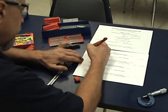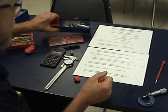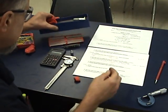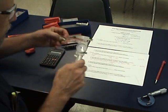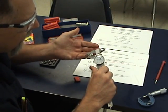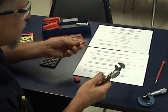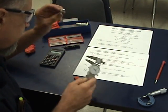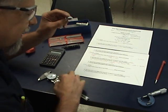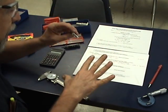I'm going to do number two right here. It's a 5/16th 18 thread bolt. I looked in my box of bolts and found something that looked close to a 5/16th. I'm going to measure it right across here and I get about 306 thousandths. That is a 5/16th diameter because the 5/16th diameter is 312 — so it's going to be about 5, 6, 7 thousandths below for clearance.